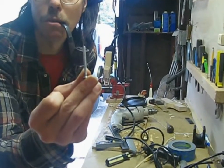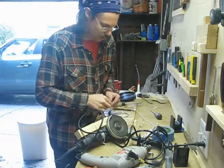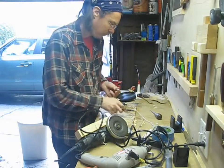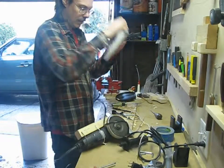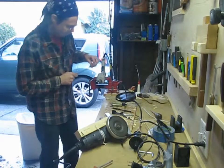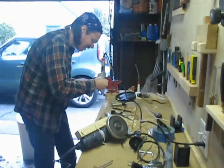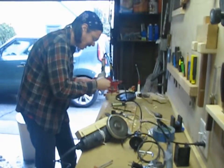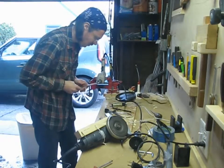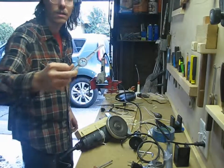This screw will adjust the depth of cut. I decided to make the screw fancy though, so I turned it into a wing screw. I learned this particular technique from an acquaintance who makes his own tattoo equipment. You start out with a screw and a wing nut — the screw head should be just a little wider than the inside of the wing nut. I haven't shown you how to build a lathe yet, so we'll turn the screw to the diameter of the wing nut threads with my electric drill.